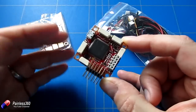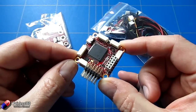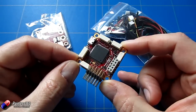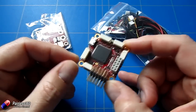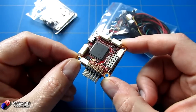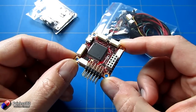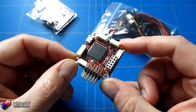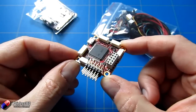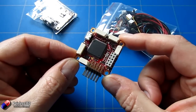We won't be able to finish the configuration because a board like this without all the other things plugged into it can't be configured completely, so we'll have to plug in things like the GPS and other stuff to complete that step. Then we'll talk about how you'd make those connections to things like the external GPS with magnetometer, the receiver, the power distribution board and power module, the optional buzzer and switch, and also the motor connections. The next video will then cover calibration and setup in far more detail with everything connected.